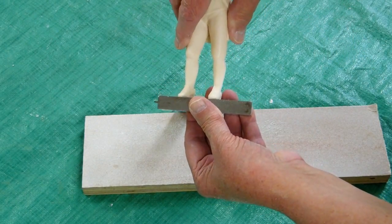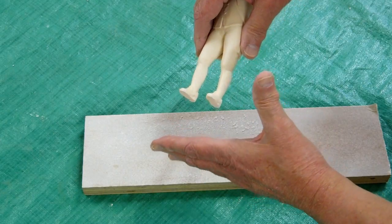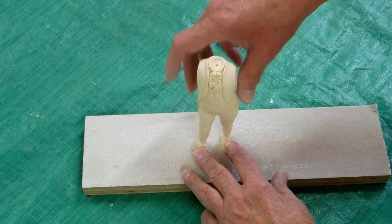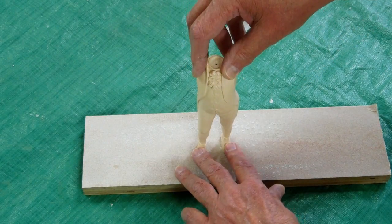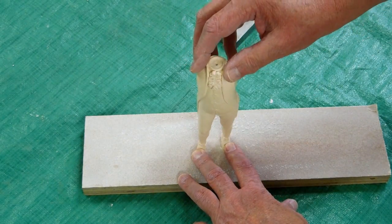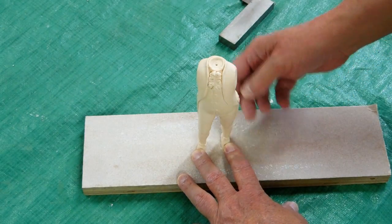The reason for having both of those feet absolutely flat — we'll drill this out and tap this. This is what's going to be bolted to your platform. You want a firm understanding; you don't want that to be wiggling side to side or rocking back and forth on a foot. Those bolts will be just snug. We don't want any movement in there — nothing that would promote a possible failure in a foot or in a leg.